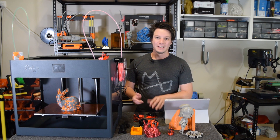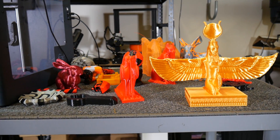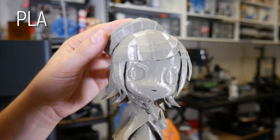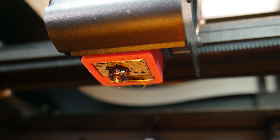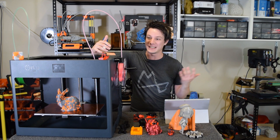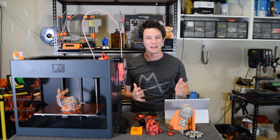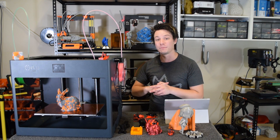So how do I wrap up this review? I haven't even really talked about print quality because, as you would expect, it prints really well in a wide range of materials. The prints are accurate and beyond getting the slicing and temperature settings right, the machine is incredibly capable. The hotends are all metal, capable of heating to 300 degrees Celsius if you really wanted to. But the machine being open on top and at the front will limit you to printing these materials without warping, unless you somehow enclose it — and then you'll probably get good success with large ABS prints, nylon, or even polycarbonate.